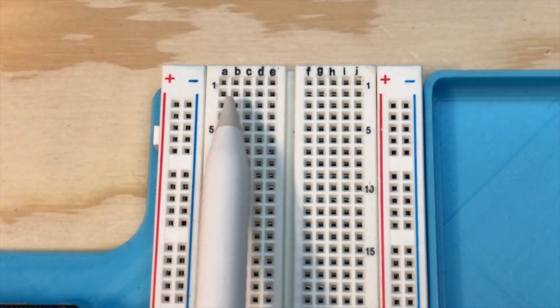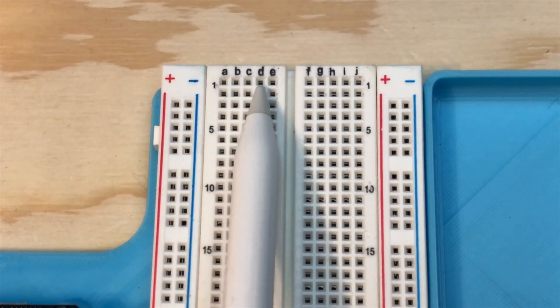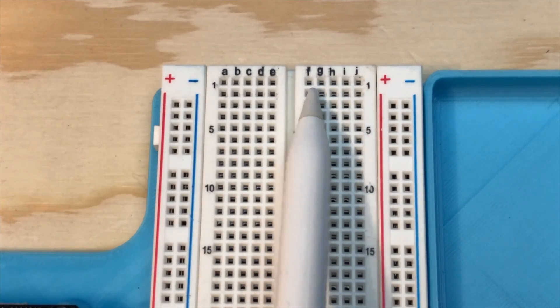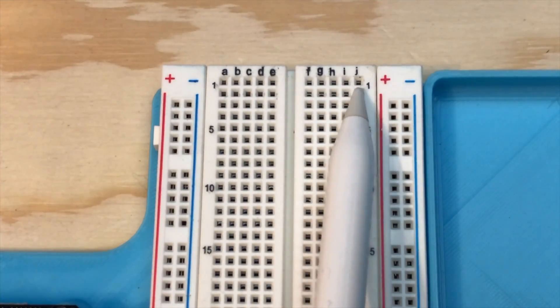Now you can see behind the scenes to understand. I'll show you side by side with a regular breadboard. Every place you see metal strips, those are potential connection points. Each one of these strips in the center section connects a group of five holes together. Along the edges, where we have the power rails, you can see that each individual column is connected along its entire length. So on any given row, anything plugged into A, B, C, D, or E will be connected together, and anything plugged into F, G, H, I, or J will be connected together. But the two red strips aren't connected together, and the two blue strips aren't connected together.